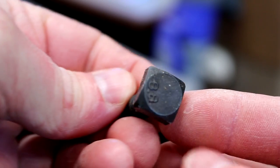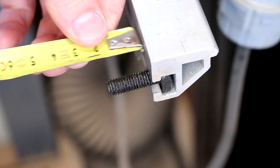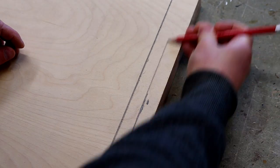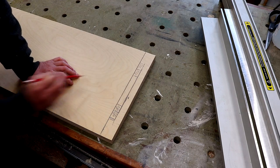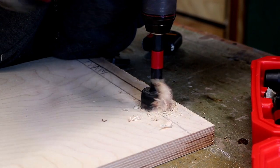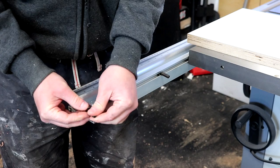I've got some spare square-headed bolts that came with the saw. These fit into the fence rails and here I'm marking up where the bolts are going to be onto the underside of the plywood. I removed some material from the back using a forstner bit just to create a bit of extra space around where the ends of the bolts will be, to enable me to add a washer and nut on the end.